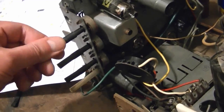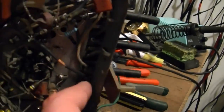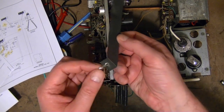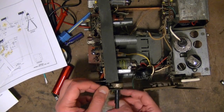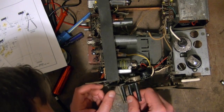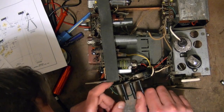So this one's frozen, and these two sound terrible. Oh, that's handy. They're mounted on a little sub-assembly, so I can take these two nuts off and loosen them up. Otherwise, I thought I was going to have to dig down in there and try to somehow unsolder those lugs. Just removed 2 screws and unsoldered this little tab here that's holding this piece of cardboard insulation. And I pulled back on this plastic tube at the bottom that hooked onto a coil down here, so now I can kind of get at it well enough to unsolder those few wires, that's for sure. It looks like they only use 2 lugs on the top 2, the center and one on the outside, and all 3 on the bottom one.